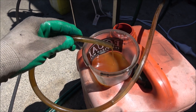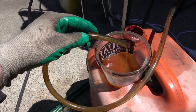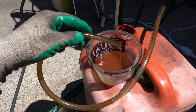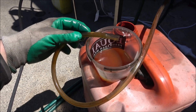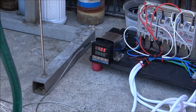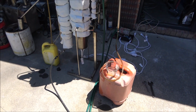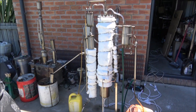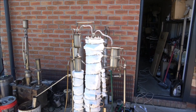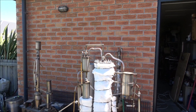I've added the oil that was pushed out of the still after priming — from the metal container — back into the supply container, so nothing goes to waste. Running it right now. The temperature is set to 413 and it fluctuates between 407 down to 403. This unit is a continuous waste motor oil distillation unit. It's relatively simple — it hasn't got any column; it's got some sort of internal tray catching all the vapors.